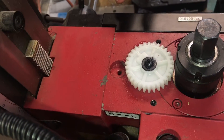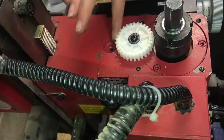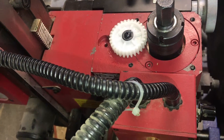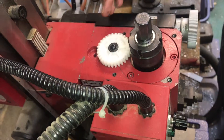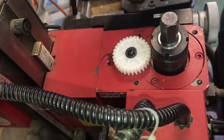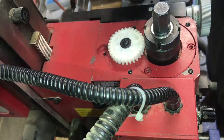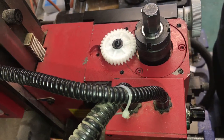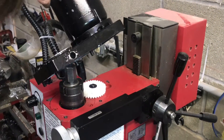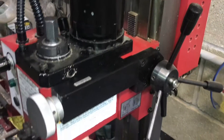As much as it is a pain replacing plastic gears that break, it is a smaller machine not intended to be used with as much power. So actually it is kind of nice that there is a pretty easy-to-access fail-safe, so the plastic gear will always break before one of the metal gears.